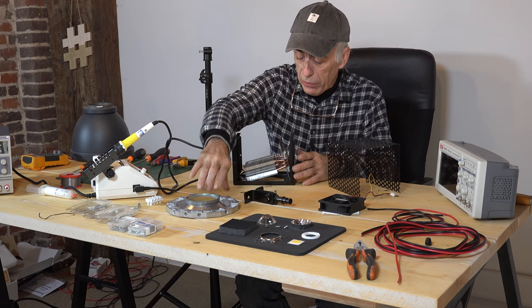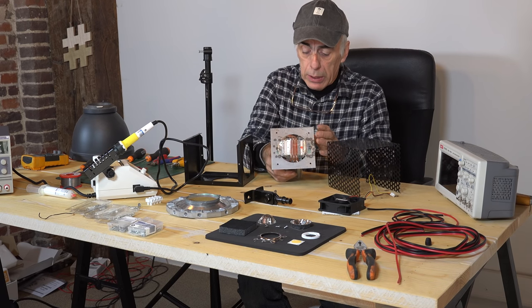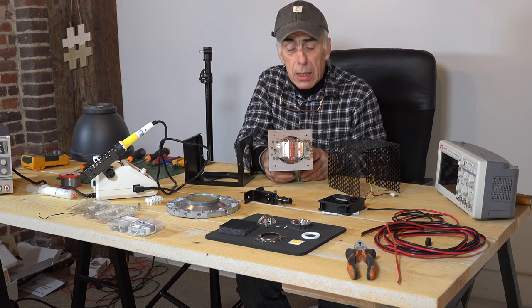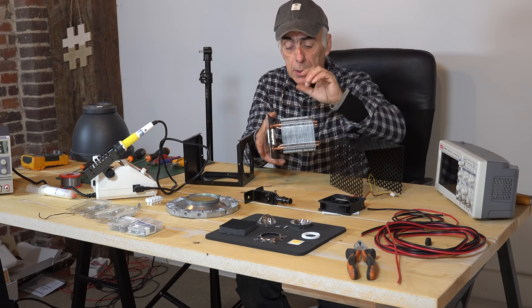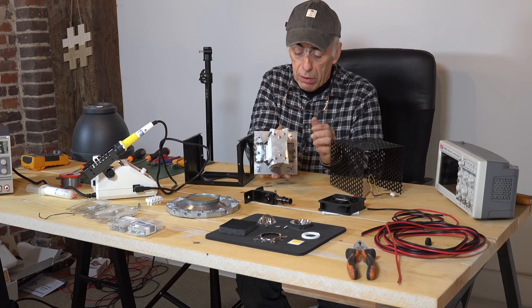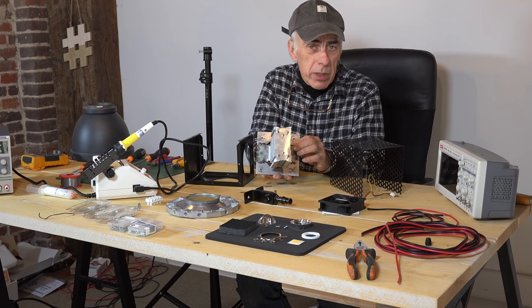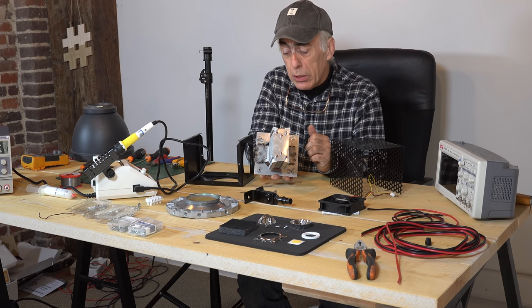That's one of the things I had to create and I have it built already. You can see that in more detail here. I had to create this back plate anyway because I had to mount the cooling element. This is the cooling element and it had to be mounted on the back plate — you can see if you look close enough how I welded that in. You can do it with bolts as well; I just spot welded it because that was the easiest and fastest way for me.